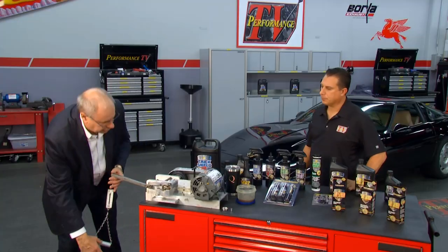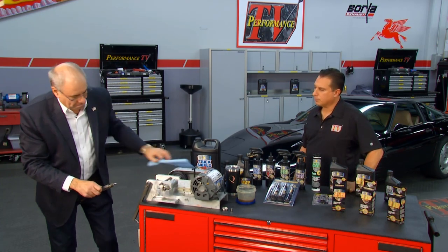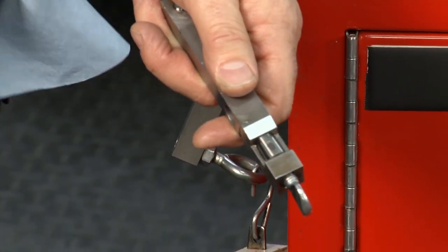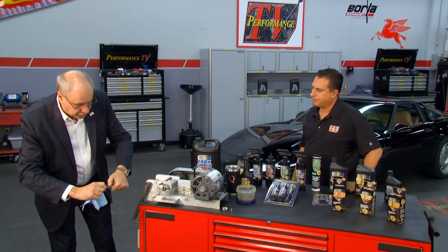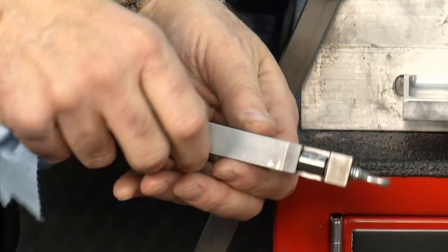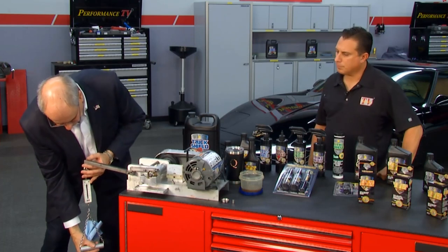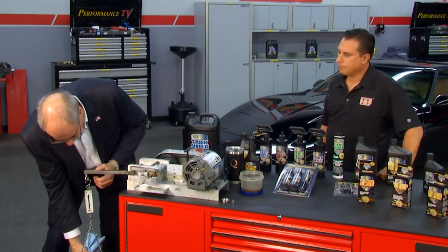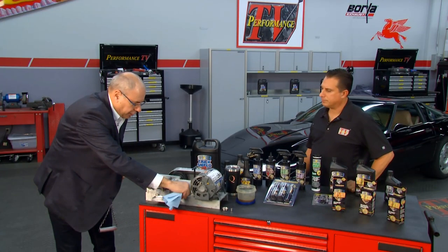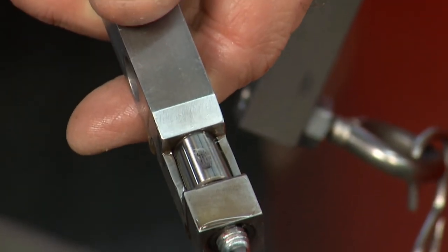Wow. We filled close to 10 pounds, and already you can see the wear that's taking place. Even with oil, it just stopped — heated up. Just to show you the consistency of the test machine, we'll turn it to a new spot, put it back on, and pull it down again. And shut it right down. Nine pounds — again, about the same wear mark.